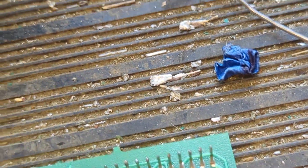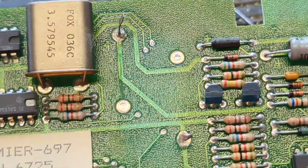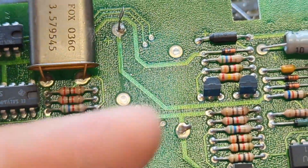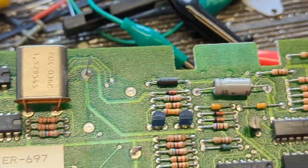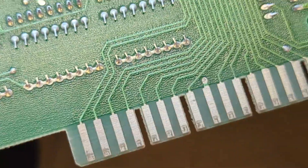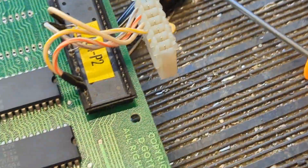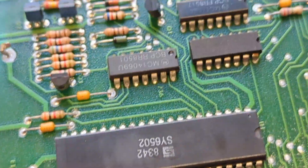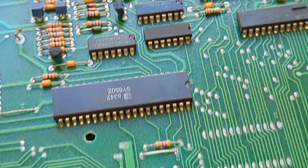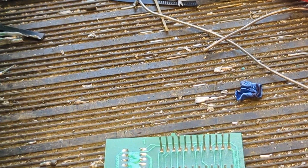While I've got this out — this game had a battery that was barely hanging on, and it looked like an original battery. Fortunately it hadn't leaked yet, but I'm going to put in a coin cell battery with a blocking diode. I'll clean up the pads — they look pretty decent, maybe just use a pink eraser. They're actually in pretty good shape, and this board will be ready to go. It doesn't look like it's ever had any work done to it at all; it's completely original, which is pretty nice.